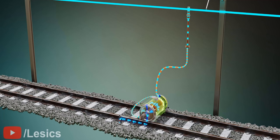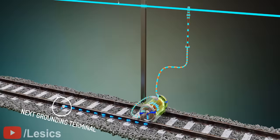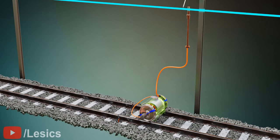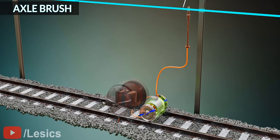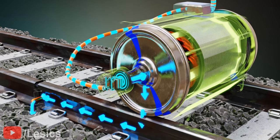A spinning wheel will move forward, which means the next grounding circuit should be available at a very short distance from the previous one. The axle brushes are fitted to the rotating wheel, and the current is transferred to the wheels through these carbon brushes, which slip over the disc attached to the wheel axle.